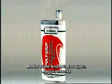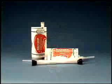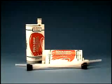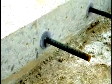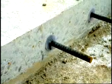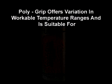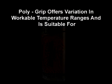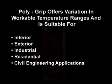Seal-Tite Poly Grip is a two-component, polyester-based anchoring adhesive that comes in a unitized cartridge system. Its non-sag, high strength, very rapid curing and hardening properties ensure minimum down time and quick bolt-up time. This makes it ideal for structural anchoring and doweling in temperatures ranging from 20 to 120 degrees Fahrenheit (minus 6.7 to 48.9 degrees Celsius). Since Poly Grip offers work crews a greater variation in workable temperature ranges, it's suitable for interior and exterior industrial, residential, and civil engineering applications.